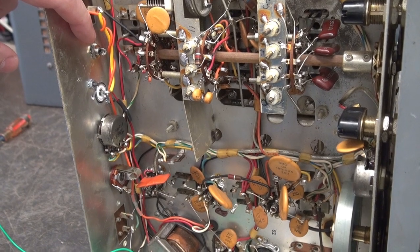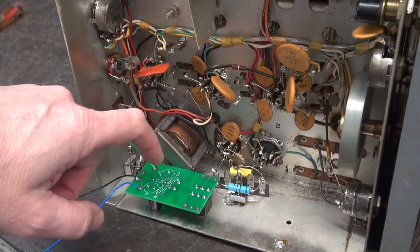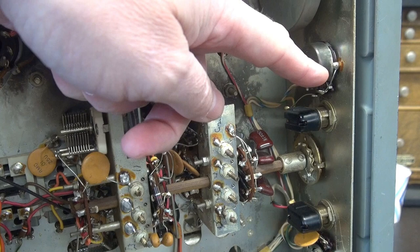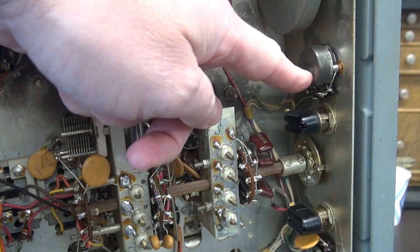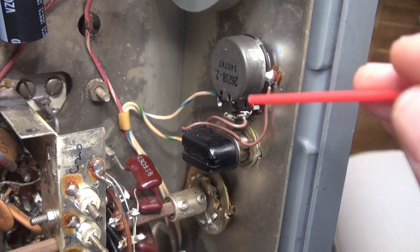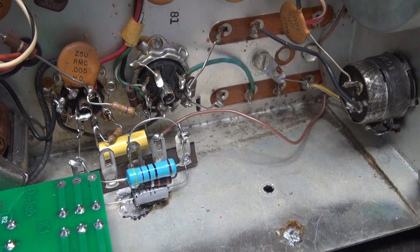There's the rear of my RCA jack. The next thing you need to do is find the location where you'd like to place your K1S module — I glued mine right down here next to the audio tube so my wire lengths are short going that direction. The next step: we're going to come up here onto the rear of the sensitivity pot and remove the ground off of that pot. This switch is also sharing that ground point, so you need to maintain that connection while floating the ground of the sensitivity pot. I've rewired the sensitivity control. The brown wire is the low side of the sensitivity control, which goes down here over to this point and lands on the 10k resistor. I'll attach the hookup diagram so you can see exactly what I'm doing.